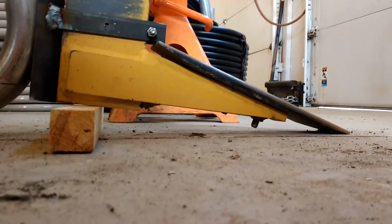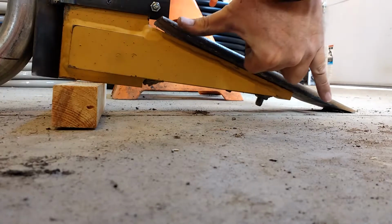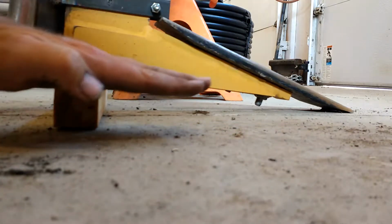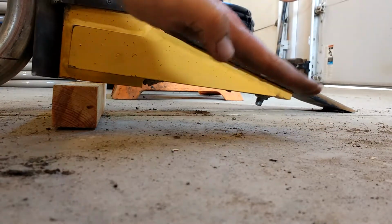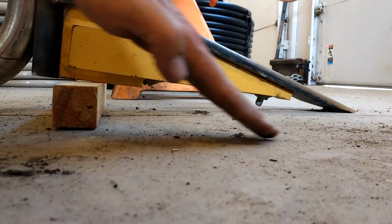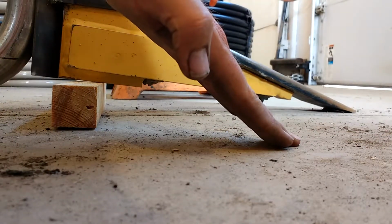What that means is, I think, that this blade, which is only this wide but is 12 inches long, if I flatten it out more, it's not going to cut much of a hole. It's just going to be like a flat piece of metal going through the ground like this. The higher I tip it, or if I tip the top of the subsoiler forward, that'll tip this blade down like this. That means it'll cut a bigger hole as it's going through the ground, right? It'll still be the same width, but it'll be taller because the back end is sticking up higher.